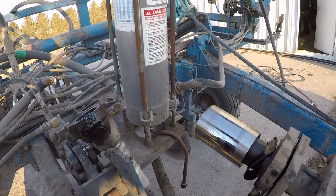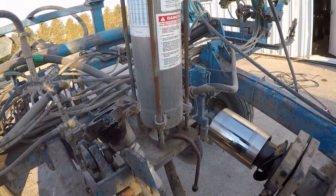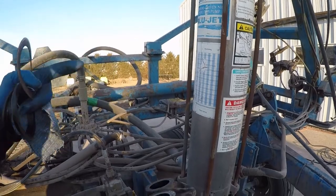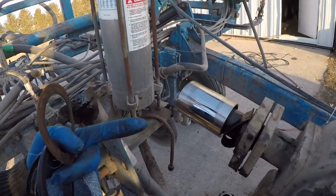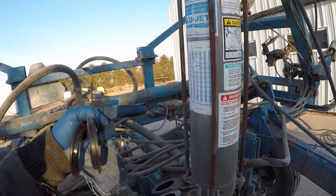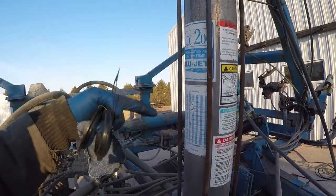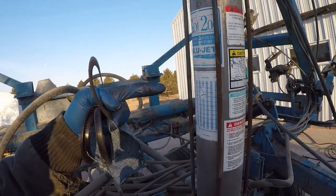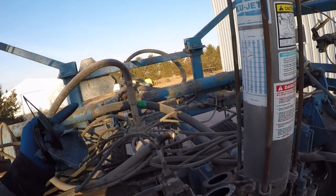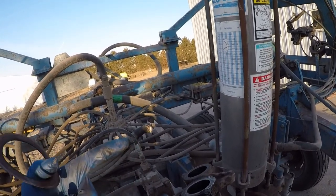One thing to address - if you're wondering why I didn't do this yesterday when I realized it wasn't putting on the rate I thought: getting it primed initially is a real pain because this whole cooler thing has to get full of liquid before you can get liquid to the pump in order to prime it and really pump effectively enough to meter from the tank. The whole purpose of the condenser is to make sure you always have liquid coming to the pump by changing from liquid to vapor in a separate chamber, so the cooling of the gas expanding condenses any vapor coming from the tank - since you sometimes get a mix of liquid and vapor going up and down hills.